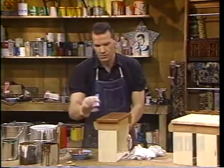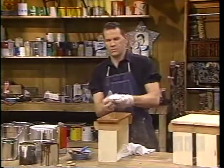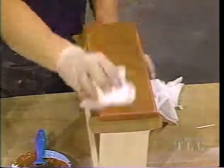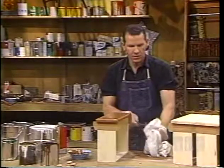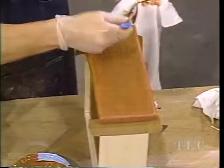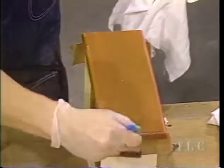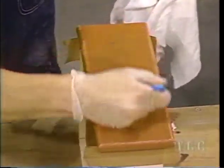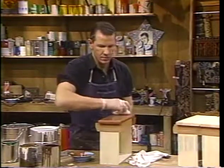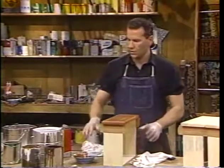I'm going to paint this on and then wipe it off. It's going to lay on top of the wood rather than penetrate. Take the rag, just like this, and wipe off the bulk of it. Then drag the brush across to see what that does. Now we can wipe off a little bit more if you want, and go right to the next drawer.